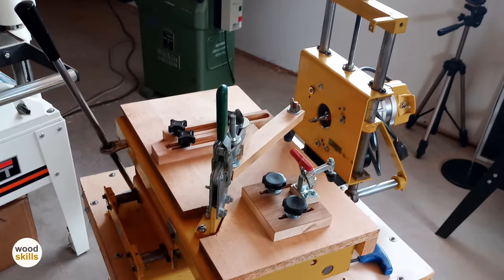So this is the more recent mortising machine that I've refurbished. Again, it uses an end mill to create the slots. The work surface has been upgraded with toggle clamps. And you can see in the images how the work table, the work surface, has been upgraded to hold the components for furniture. This router as opposed to the hand drill in the earlier version.